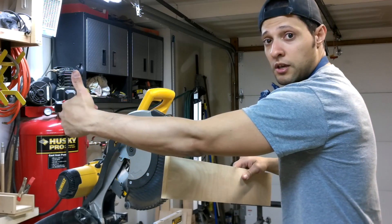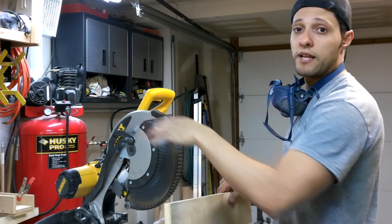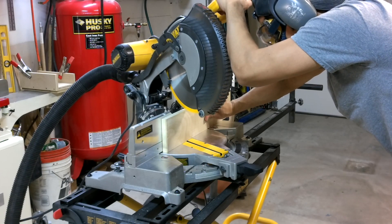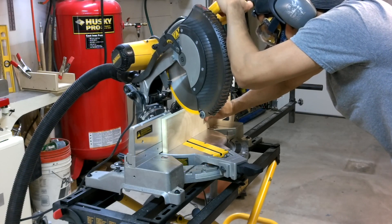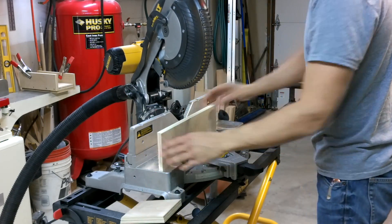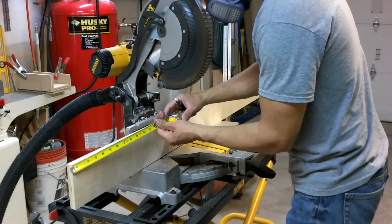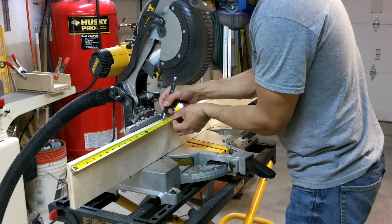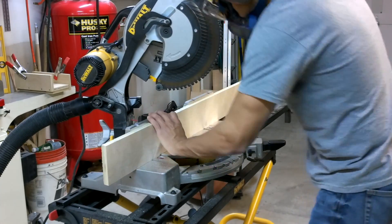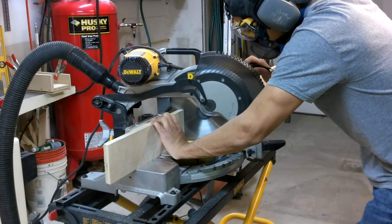Then I'll have to go and measure the next piece over that completes that corner cabinet, and then we can just do the straight run with one miter against the last wall. Then we're done — a little stain on it, let it dry, put a little finish and nail it off. Now I'm going to cut the other side of that piece since this angle is going to be 22 and a half degrees, and that's going to make up the other side of that angled cabinet. I made a cut list and measured all the pieces in one shot — I took an angle finder up to the cabinet and measured the exact angle of each piece, marked everything down on paper, came down and cut everything all in one shot. This way it's a lot quicker and a lot easier to get everything done.